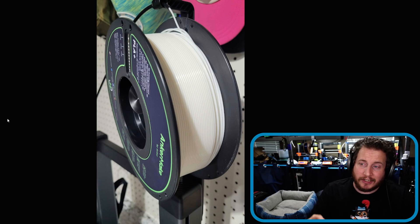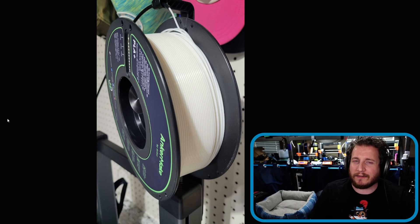If you didn't catch it in time — and this one looks pretty tight, so I'm not certain he did — well, at least it didn't waste any more filament. You will need to check your extruder drive gears. If after fixing the filament it's not extruding properly, check those drive gears to make sure they're not caked up with filament and are still providing the proper amount of tension.